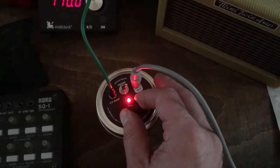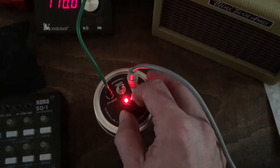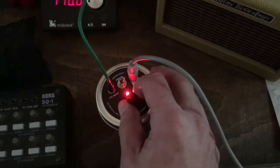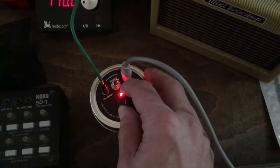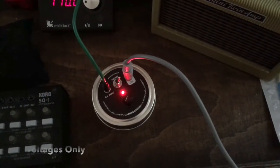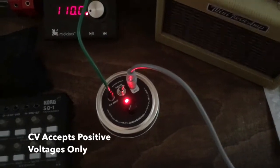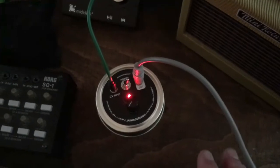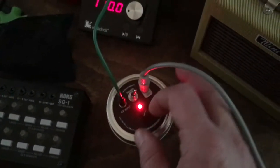You can see we kind of get some random changing glitch algorithms. We can use the pot to offset that — you really want the pot down lower to get a longer range. It does accept positive voltages only, so it's not really good for LFOs; more for pitch voltages, opening envelopes, and things like that.